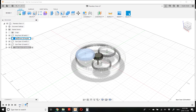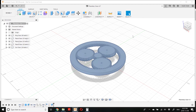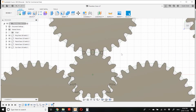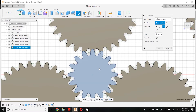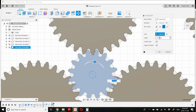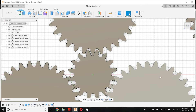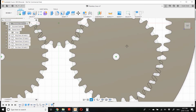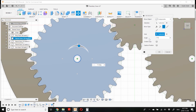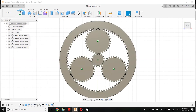To stay organized, I'm going to rename our gears — renaming the planet and the sun components. Switching to a top view, we can see that our gears aren't meshing correctly in all cases. The top planet looks OK, but both bottom planets and the sun gear are a little bit out of sync. So we'll press M, choose Rotate, pick the component and then the axis, and rotate each gear visually so that they mesh correctly. Sometimes you might have to type a fraction of a degree in the text box. Once everything is meshing correctly, let's capture the position.